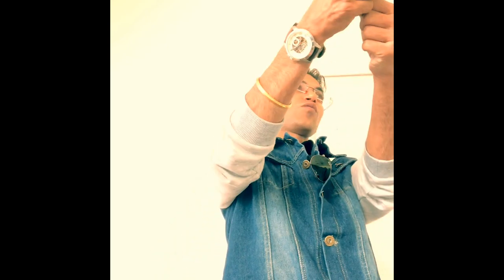The weight of the hammer required can be found with experience. Before use, it must be ensured that the head is secured to the shaft, very essential, or else you will hurt yourself and you will damage the aircraft. The shaft should be gripped close to the opposite end from the head. Quite naturally, you won't be holding near the head because you require more moment arm, isn't it?